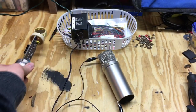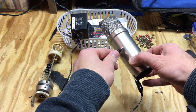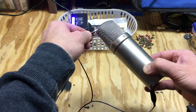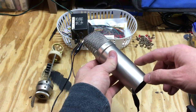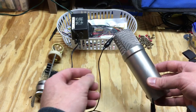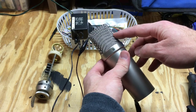That still wasn't the issue. I actually watched another video where somebody else had a very similar issue. This is a continuity checker — when you have a connection it just lights up. You're supposed to have a signal through the body and the screen here, which kind of acts as an electrostatic shield and keeps noise from getting into the mic. As you can see, if I move this screen around I can get the light to go on and off.